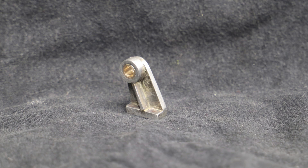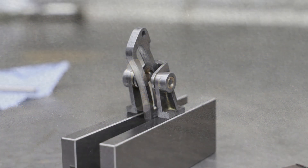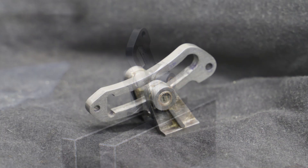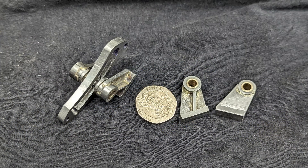I still need to drill and tap the holes for the mounting bolts and the corresponding holes in the motion plates, but I'm going to hold off doing that for now, as I know I'm going to need to make some other changes as a result of pushing that piston centre line out by an extra millimetre. In the meantime I'm going to progress with the remaining valve gear and come back to mounting these later on. I also need to figure out how to clean those surfaces around the rib. But anyway, as always, thanks for watching.